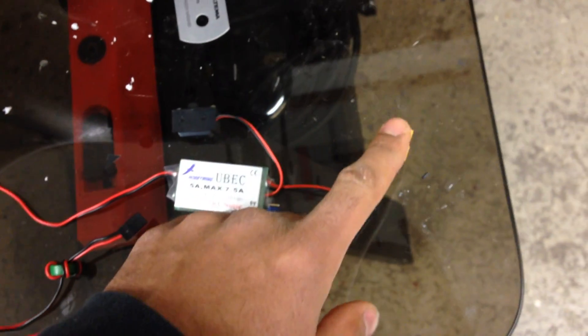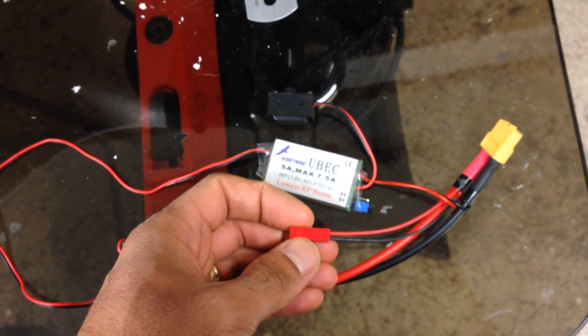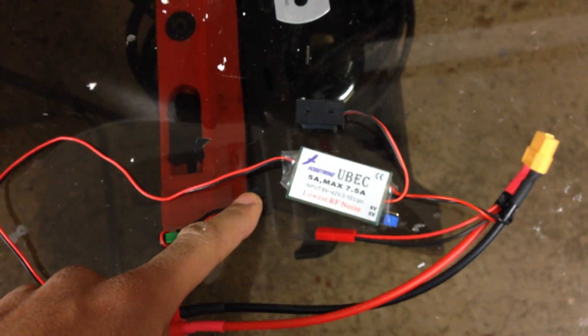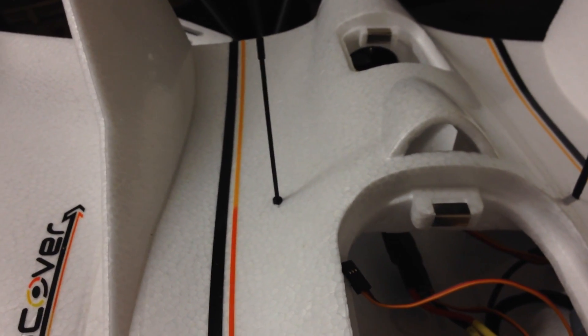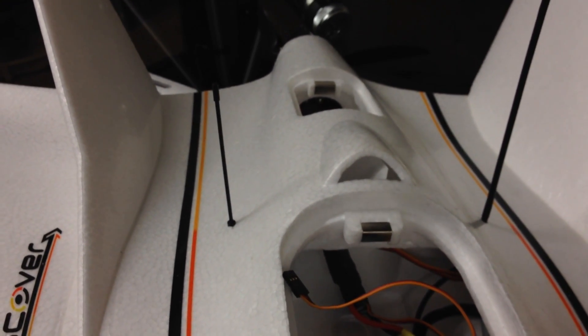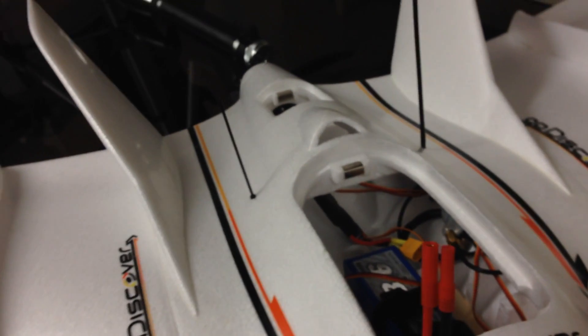This connects to the battery, this connects to the ESC, and this JST connector here is to solve another problem I'm going to come across — the 4S battery is 14.8V and the power coming out of the UBEC is only 5V, but I'm going to need 12V to power my 1.2 GHz video transmitter. You don't have this problem if you use the 5.8 system from Immersion RC, because that just takes power from the balance plug and can handle 4S input. But I like to run 1.2 because I like to fly behind trees and buildings, where 1.2 is just a bit better.